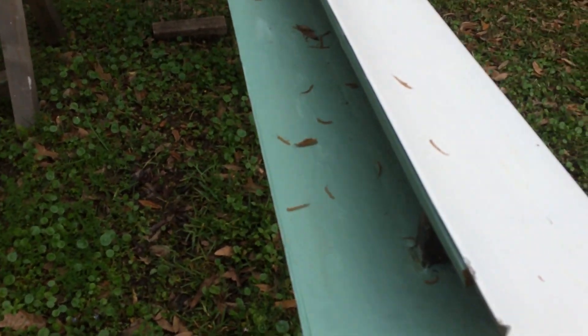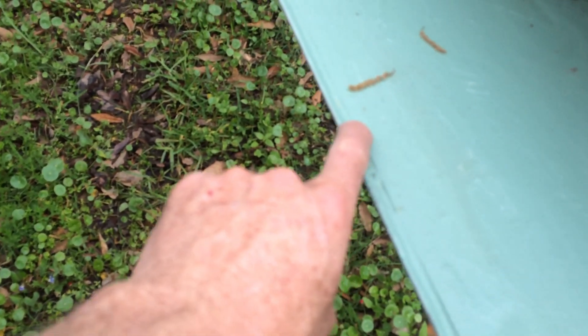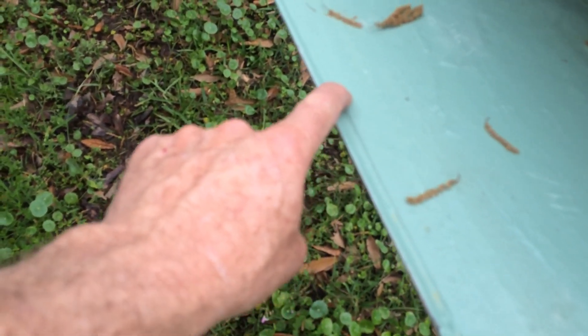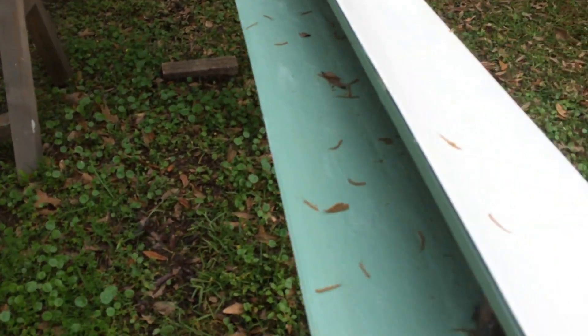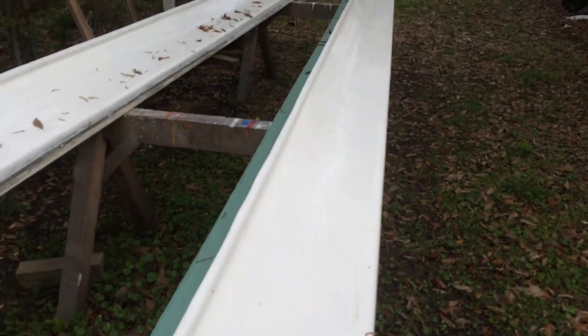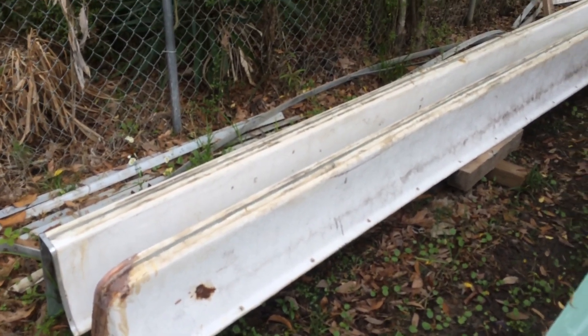All four of them have been patched as far as replacing the plywood. I was very careful to seal this edge with both resin and paint, because I think that's where the water got in to cause the rot problems. So they've been patched, and these two actually have a coat of fresh paint on them — you can't tell because pollen's got them covered up. But good progress — two ready to go on the boat, and two that have been patched. These others just need to be painted.